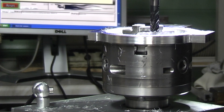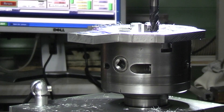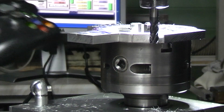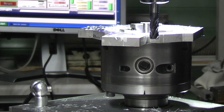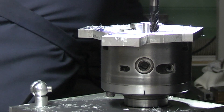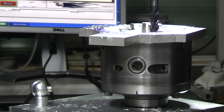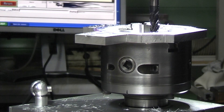There's plenty of room in the box to fit it. What I want to do now is come in with this - that's 29 degrees. Let's lift the spindle up and test it, so I want to go from zero to 29 degrees. Just rotating it with the computer to see where it will go. This speed is running at 60 millimeters a minute - that's a very fine pitch.